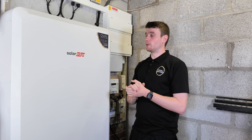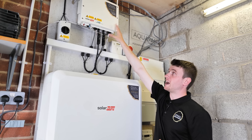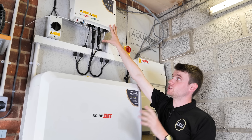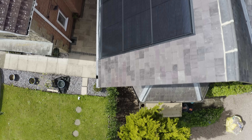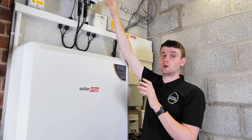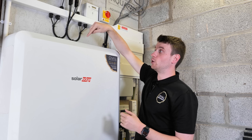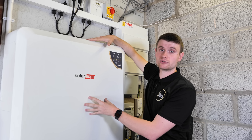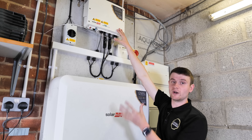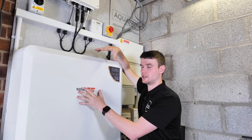When it is working, it's a fantastic unit. One other thing to quickly chat about: if you had quite a large amount of DC oversizing — say five kilowatts of panels attached to this 3.5 kilowatt inverter — the inverter can only ever generate 3.5 kilowatts, but the panels may be able to send down five kilowatts. Without a battery, the inverter would clip that energy to 3.5 kilowatts. What it can do now is put that clipped energy into the battery, so you're generating 3.5 kilowatts and there might be a kilowatt being charged into the battery that would have been wasted otherwise.